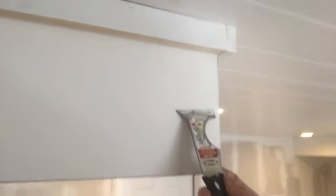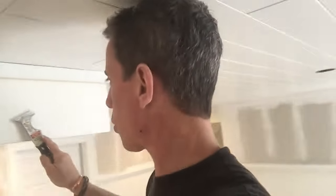Next, what I'm going to do, that's flat. And you can also do it too for little hunks of drywall, joint compound that you missed. Keep the blade nice and flat, the angle low to the work, so you don't gouge it and have to make a repair. Okay, next thing.